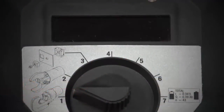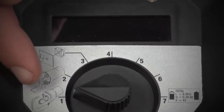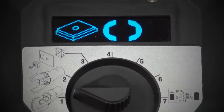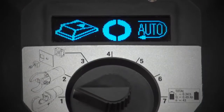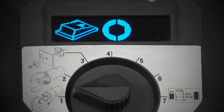Now we're going to walk through the dashboard or display on the EHP 700 from Greenlee. There are seven different positions on the dashboard. Number one is for crimping, two is for cutting, three is for punching, four through six are reserved positions, and seven is the diagnostics check. Starting with the crimping designation in selection one, it gives a full readout and graphic description featuring our auto-retract, manual retract, and manual retract repeat features incorporated into the IntelliCrimp system.